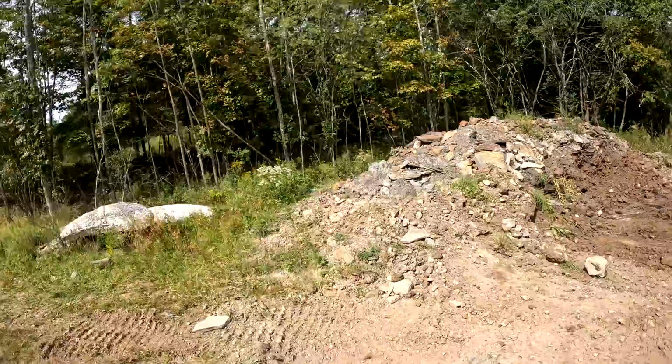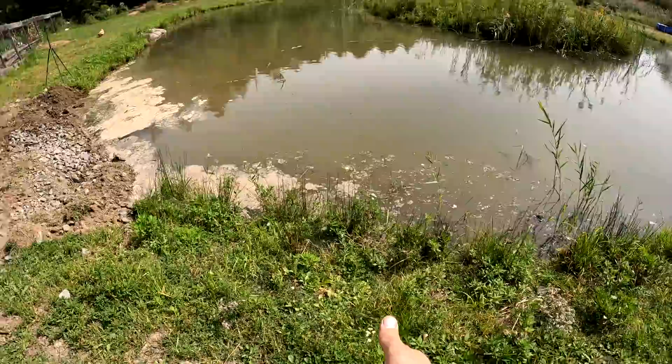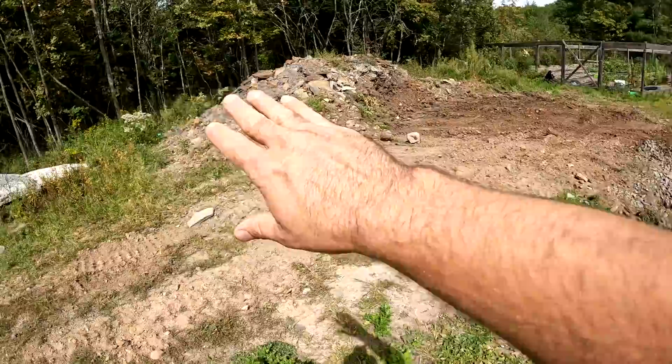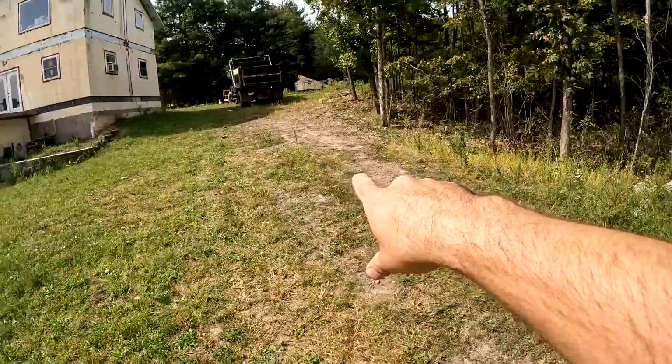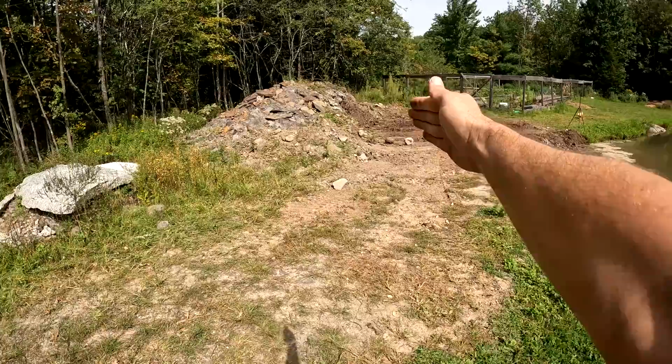I need to install this loop. It's gonna come in right through here and be something like that. But at the same time, this is where my solar panels are going to be. So rather than dig for a new trench in the future for the solar panels, what I'm going to do is put conduit in the trench with these geothermal pipes and bring it over to here. And then somewhere right about there, I'm going to Y off of there and go over there with the conduit.